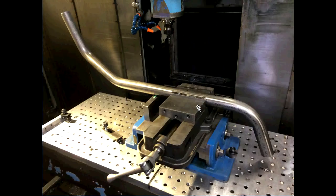Basically, the pipe is sitting flat on the base of the vise, and I've got a parallel out here that's the same height — two and seven eighths. I had to put it up on some sort of a riser, and I happened to have this tilt plate, so I just set it at zero degrees. That got me up enough to clear the end of the pipe from the table, which all worked out well.